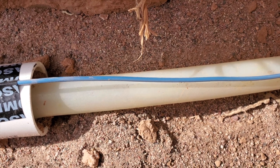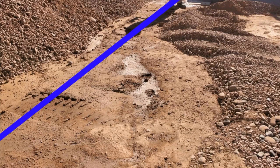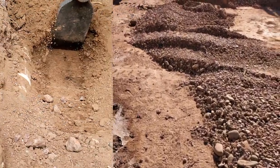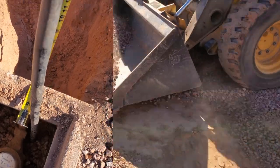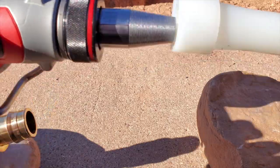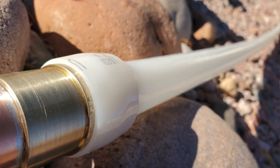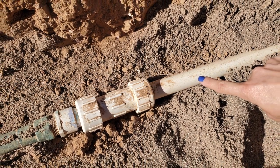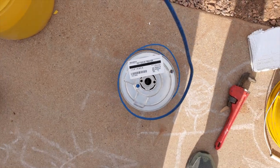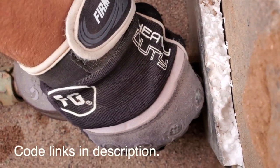They use a wire tracer to detect where the tracer wire runs underground to help mark the lines so you know where you shouldn't dig or where to dig if you need to make a repair or replace the water main. The fact that you have tracer wire means you probably have a PEX or PVC line running through your yard, and your water line is probably newer than 2009 when tracer wire was put into the Uniform Plumbing Code in Section 604.8.